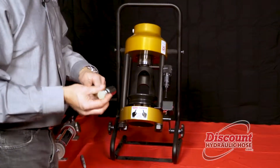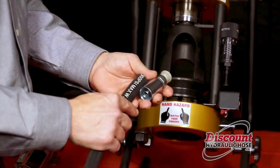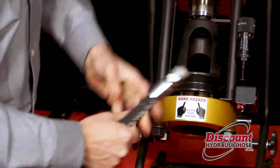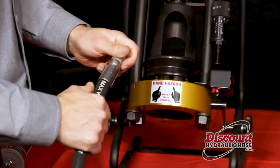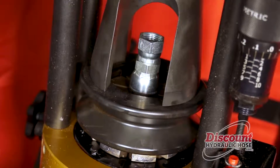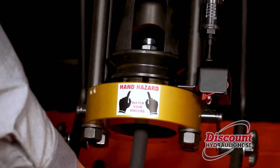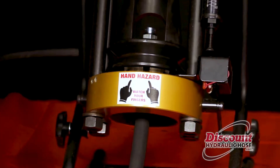What's very important is you identify how far you're going to put the hose end on the hose. You're going to line up the dashes on the top of the hose end onto the hose, take a marker, make a mark on the hose, and then push your hose end on to make sure it gets to the proper depth. Once you've reached that line you're ready to crimp. Insert your hose from underneath and line it up so the dashes on the outside of the hose end align with the top of the teeth. Then begin crimping — the hand pump will start pushing the pusher down on the compression plate, which will crimp the hose.